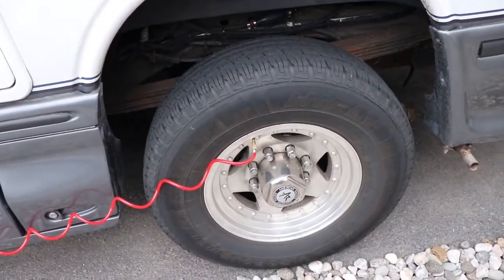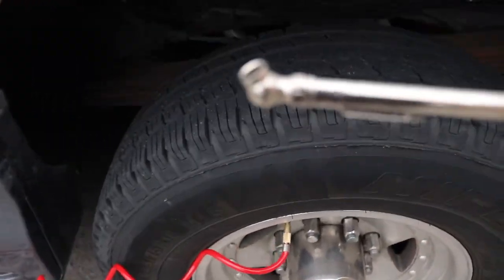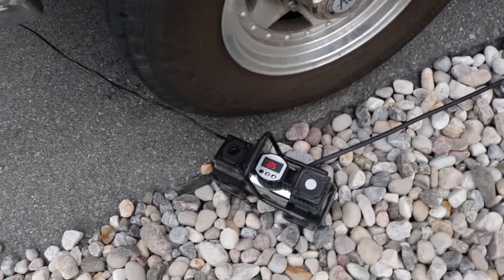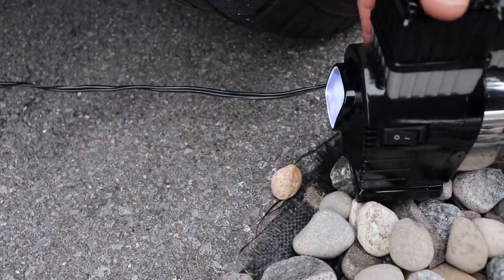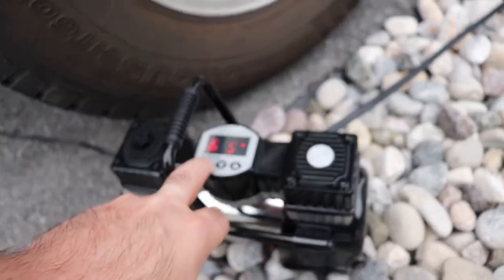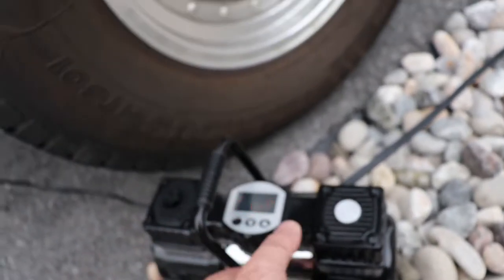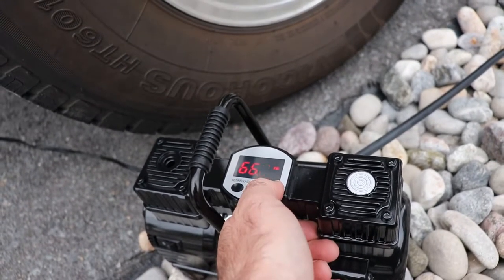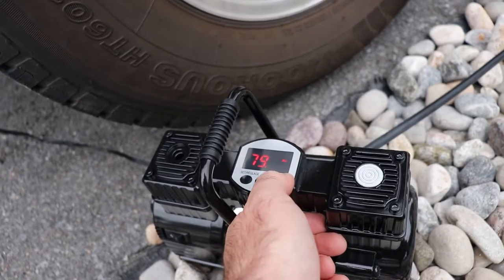So we're on here. I checked this with the tire gauge and it was 70 PSI. I used this thing here from Wilton — it tells me the pressure here is 68.5. Now it's got two switches on here: one for the light, the other to turn on the compressor. It's not going to start because it's above the set pressure, so you hold the set button — it's blinking. Now we're going to put it up to 80. You've got to push it up, so this is not ideal. You have to do this every time you want to use it.